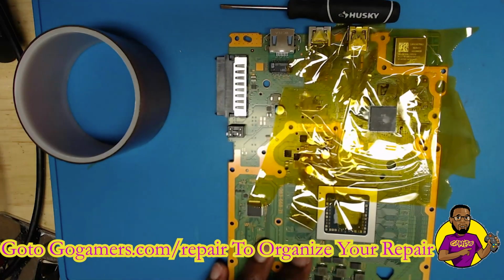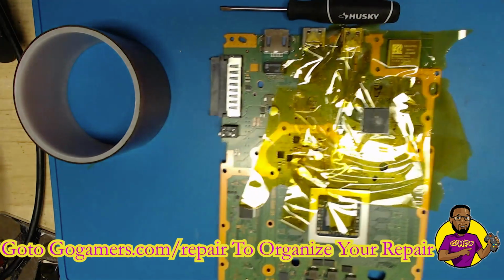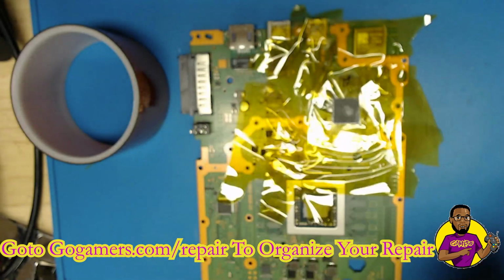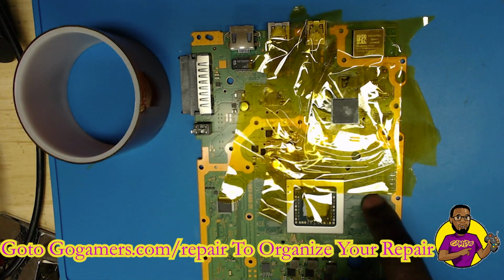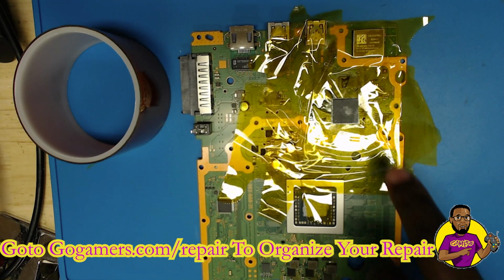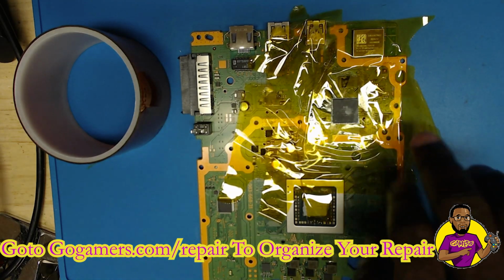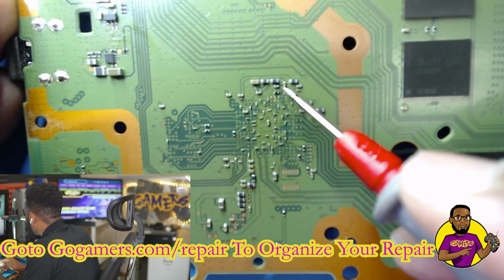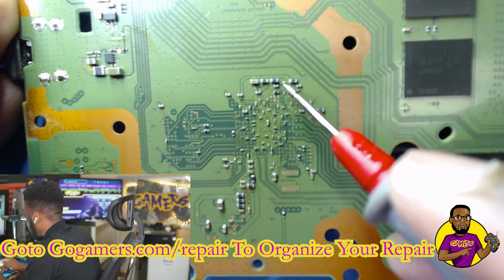All right, guys, so as you can see, we have the Southbridge reball fully back in place. Everything looks good. I'm going to put my main camera back in place and remove this Kapton tape. We're going to clean this. We're going to test that cap on the other side of the board as well to make sure that the short is gone and that this new Southbridge actually does work. And after that, we can test out the game console and make sure it works. These components right here, if they do short out, that means the Southbridge is no good.